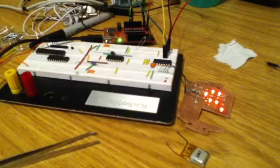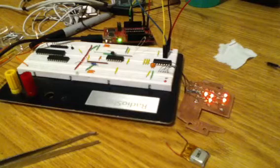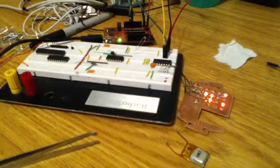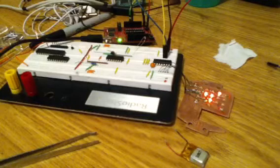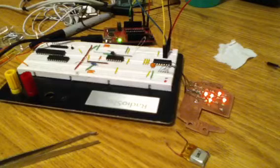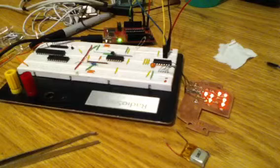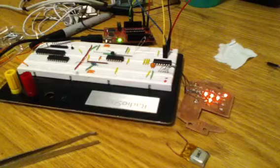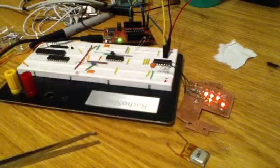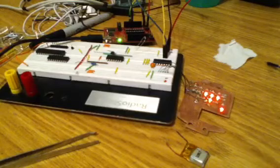So my second board accounts for both the high impedance problem, which actually isn't a problem at all, and for external charging with USB. My second board also has points on it for programming the chip in circuit, which will be an SMD chip, as the second board is entirely SMD, which makes it easier to design the faceplate, the diffuse plate, because these watches will not be just bare like this, just a bare PCB. They will have a piece of white plastic on top as a diffuse plate for the LEDs.